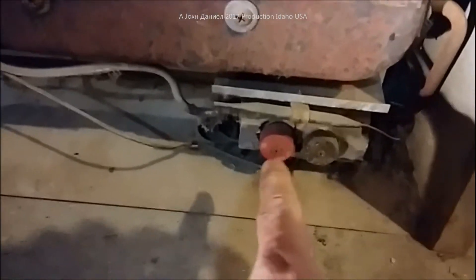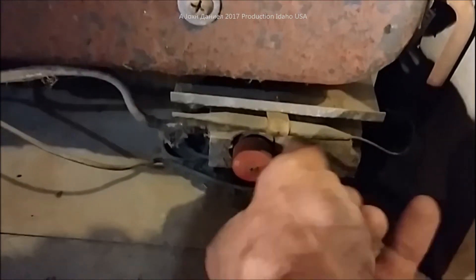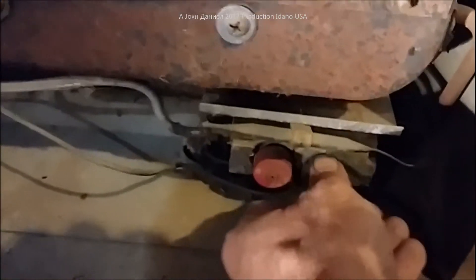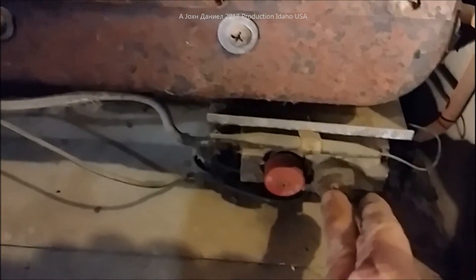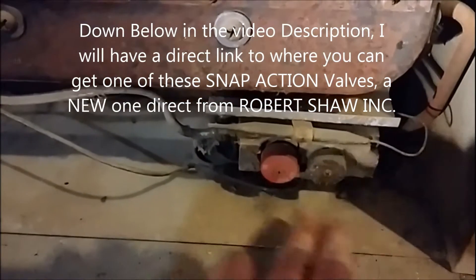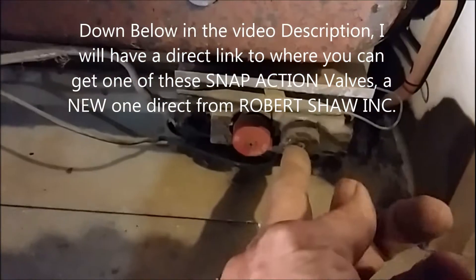It has a standard standing pilot light and a spring-loaded valve. The bulb has a liquid in it that puts pressure against the valve's diaphragm. When you adjust the temperature setting - like the old Williams and Benson furnaces - draft air comes in and controls the heat by fluid control. The hydraulic fluid pushes on the valve and closes or opens it depending on the temperature set, and they're fairly accurate within three to four degrees.